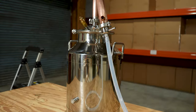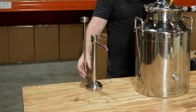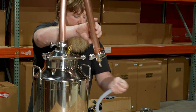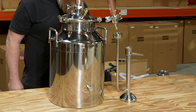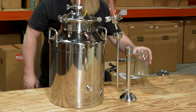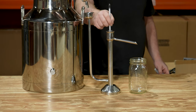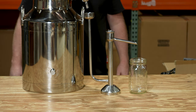For folks who have the proper licensing and permits to distill fuel alcohol and/or distilled spirits, an option here is to use a device called a parrot, which allows for proof to be measured in real time as it exits the still. Not everyone prefers to use these, but doing so is as simple as placing one under the drip arm along with a collection vessel, then lowering a distilling hydrometer down into the opening in the top.